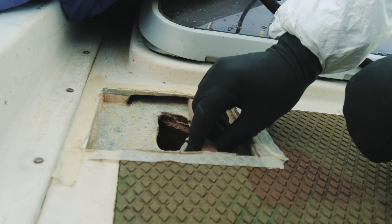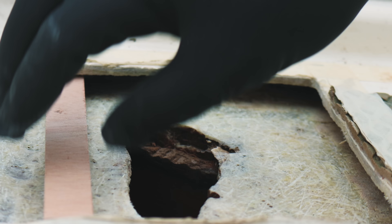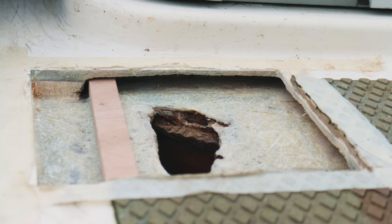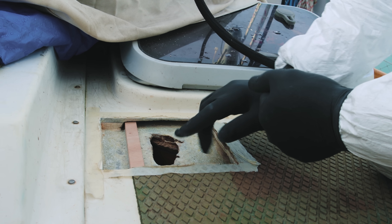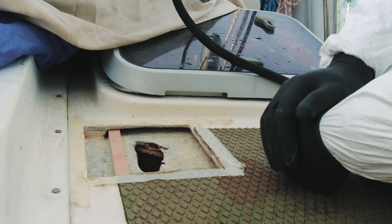That's a nice fit in there. You can see the shape we're trying to match around here. We've just got to taper our little bits of plywood and we can slide them all in, a bit like a jigsaw puzzle. It doesn't matter that they're in different bits, because all we're asking of them is to create a solid divide between the inner skin and the outer skin. So together everything becomes strong — we're not asking ultimate strength from any one piece.